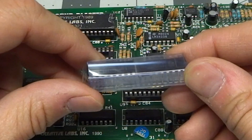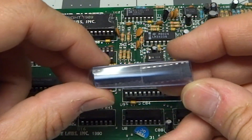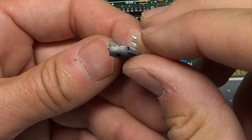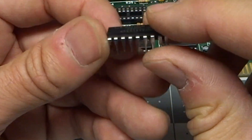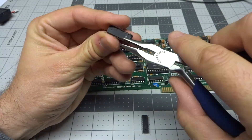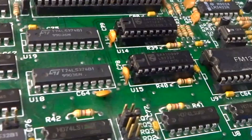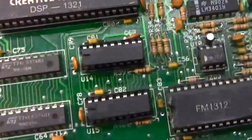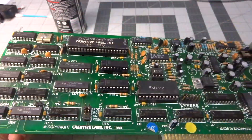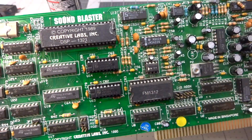So here are the two Philips chips I just got from eBay. They're a little crushed and the pins look a little bent, but there's nothing I can't fix. Let's install these into this Sound Blaster card. The pins are not exactly ideal, but when things come from China and cost almost nothing to ship, you can't always get perfect condition. The pin straightening was a little bit of a pain, but otherwise it went right in without too much trouble. I used some DeOxit on the sockets to make sure there was good contact, because this board is pretty old and a little crusty.